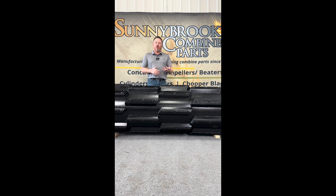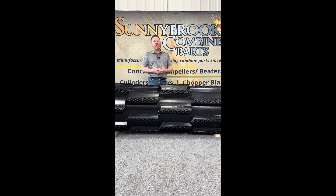Basically, what it is is a fully enclosed, high-inertia cylinder. What that means is that there is zero trash buildup. The weight of the cylinder is actually built more to the outside, so it gains its own momentum with use. It uses a lot less fuel — the engine doesn't need to run near as hard to make it spin.